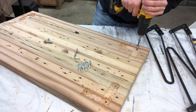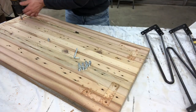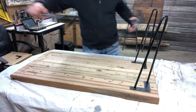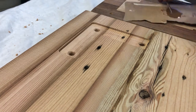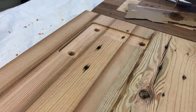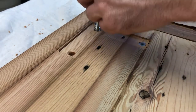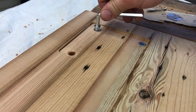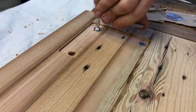You can see how fast it is with that stop — just drill it down until it stops. Clean out any chip-out that you might have from drilling the holes. Of course, test fit everything and make sure it's going to work out because we're going to be cementing it in — well, using a quick-set epoxy. It sets in five minutes or less. I get some in the hole and a little bit on the thread insert and pull it in. Your goal here is to not have any squeeze-out. This is a piece of fir — well over a hundred years old. When I feel any resistance, I just back it off and then start threading it in again. You're actually making threads into the hole.